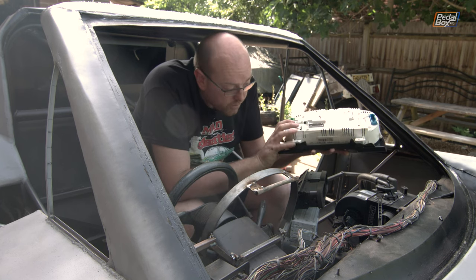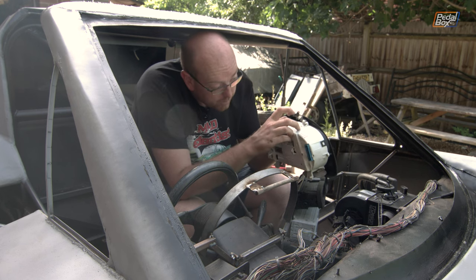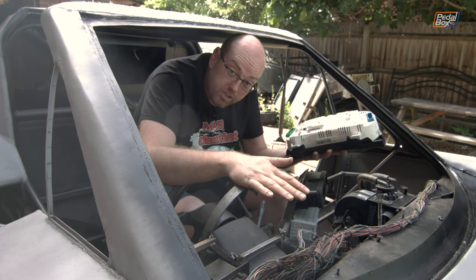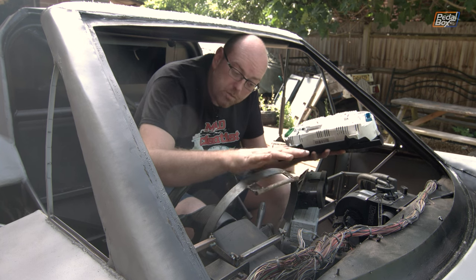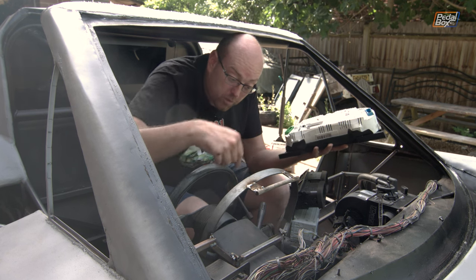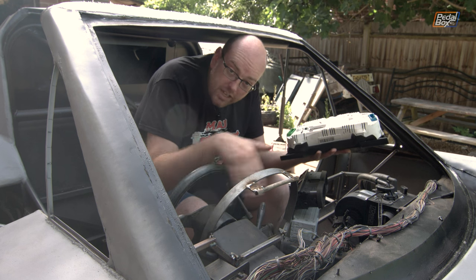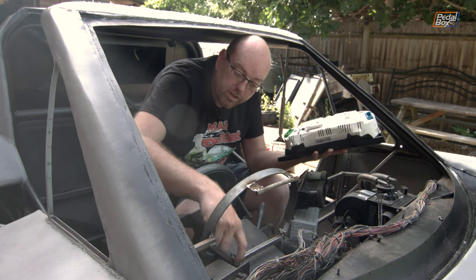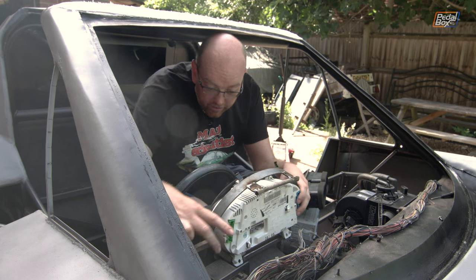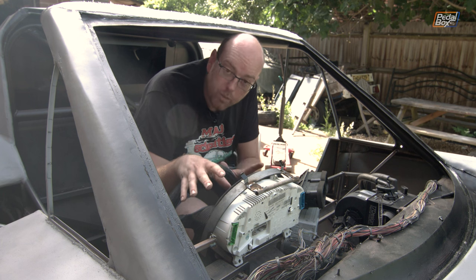To mount it in place, it's got two little mounting tabs at the bottom that bolts go through from the original system, and spring clips at the top. My plan is to use all of those in a tacked-up system to mount it in a really easy way — removable from the dashboard without needing too much work and without having to put your hand all the way up from the bottom. To locate it left and right, I started with some 10mm tube with a rivnut in each end, bolted it onto the bottom, and positioned it in the car to get it roughly in the right place. I tacked those in place and I'm pretty happy with where it's ended up.